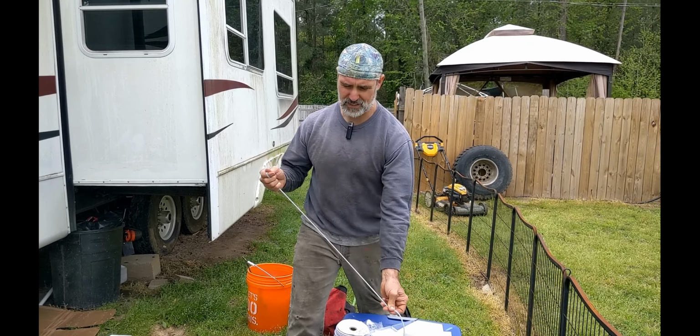The screws they supply with the knobs, and this will be true for any cabinet pull knob, assume something like a half inch cabinet face, and of course the thickness on these is almost nothing. So what you'll find is this bottoms out long before it gets tight. That's bottomed out. See, we won't be able to tighten. So you have to cut these.